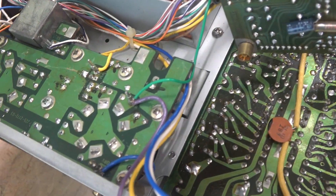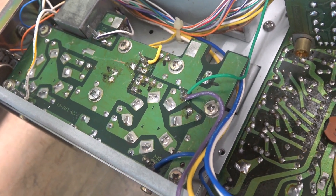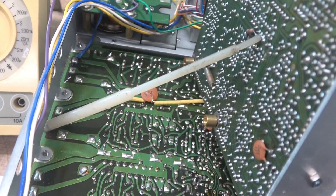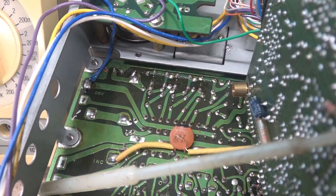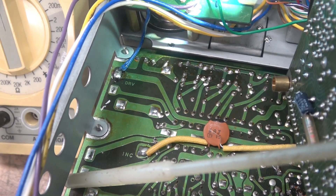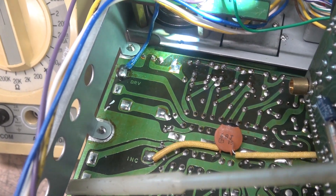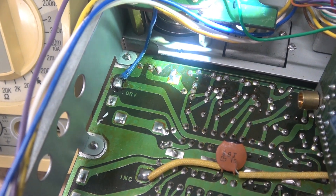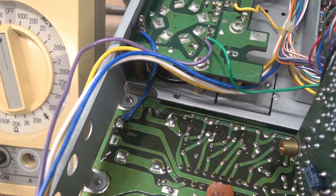Also when you're in here, take a look at the pins on the 6146s. If those connections are original, I guarantee you they're going to be cracked too. I'm going to be taking the 830 into my other bench where I have better lighting to inspect and take care of solder connections. But take a look at that wire right back there where it says drive — that blue wire has been removed at one time. It was overheated, the insulation is melted and laying right on that ground trace, so we are definitely going to replace that wire.